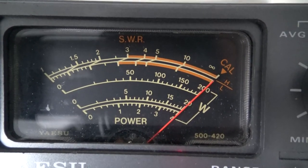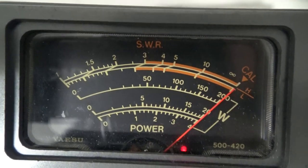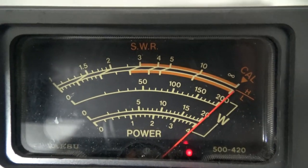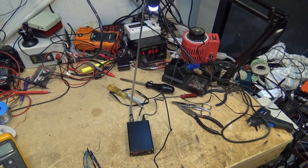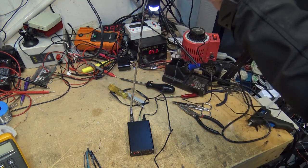Into the power meter this unit is putting out exactly 4 watts. So into a proper antenna this thing would have quite a bit of range. I'm not going to put it into an antenna — we're putting it into a dummy load just for testing — but this little unit has enough power to cover a campus quite easily, possibly even a small town. I'm just going to use this whip antenna and take a drive in my car to see how far this thing goes. I had to retune to 87.7 MHz because my car doesn't tune any lower than that.